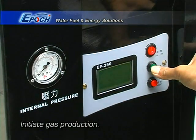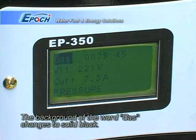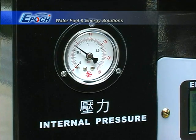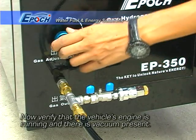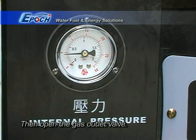Start gas production now. The word 'gas' will change to a black background and you will see the machine begin to use current to make oxyhydrogen gas. Let internal pressure rise until the word 'pressure' changes to a black background. After checking once again that the engine is running and vacuum is present, open the gas valve slowly.